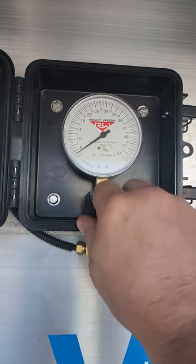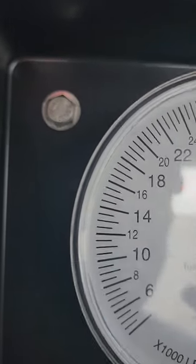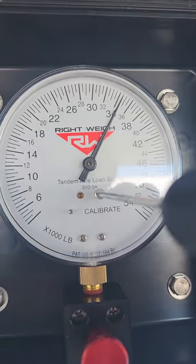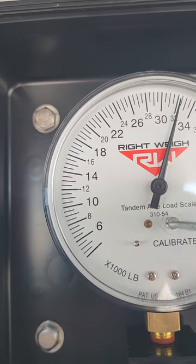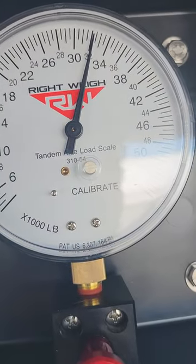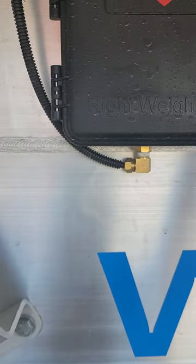I love encounters like that. I'm going to turn this around so you can see — here it is, this is the mechanical version. This is pushed in — you want to pull this out, see that? Now that is not correct. I'm not over 34, I'm just over 32. So see this little screw right here? That's what you want to move. I'm going to put my screwdriver in there and turn — very slowly, guys, very slowly. That's about right. Boom — see there, just over 32. Just a tick under 32 and a half, and that has me calibrated properly. Now I push this back in and close it. That's how you do it.